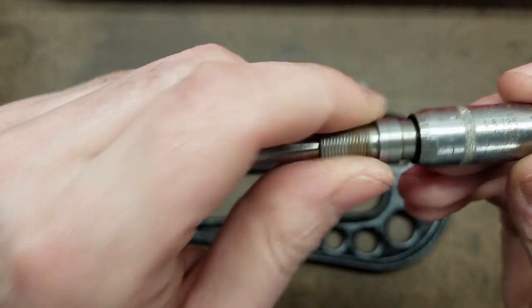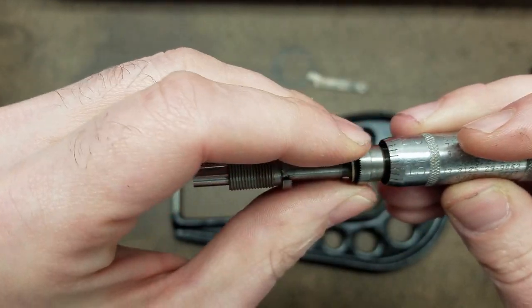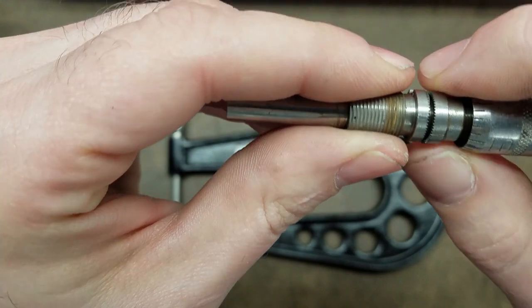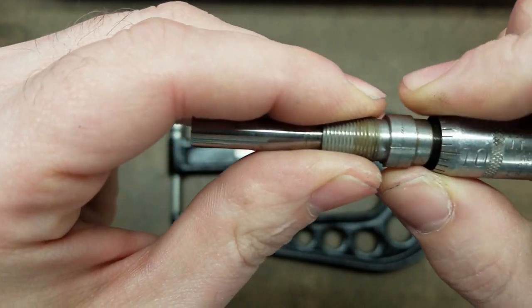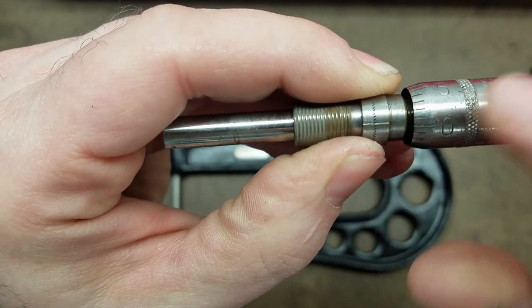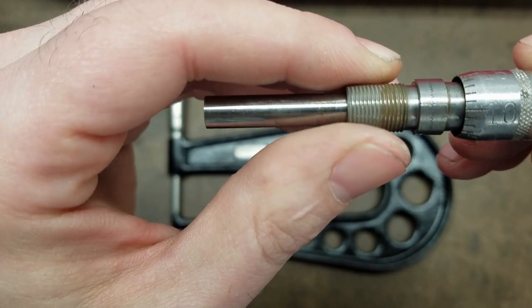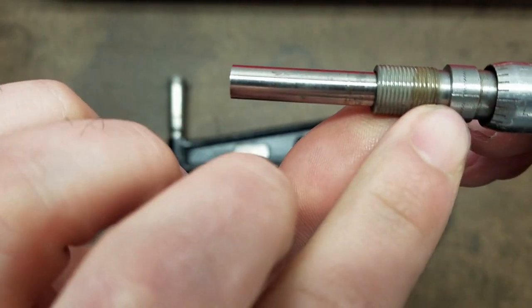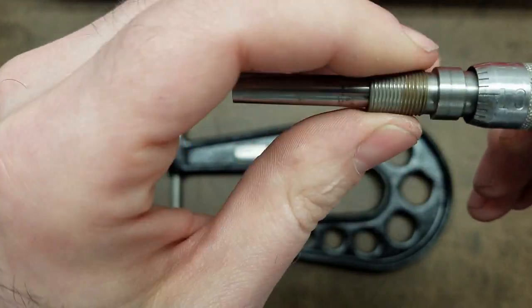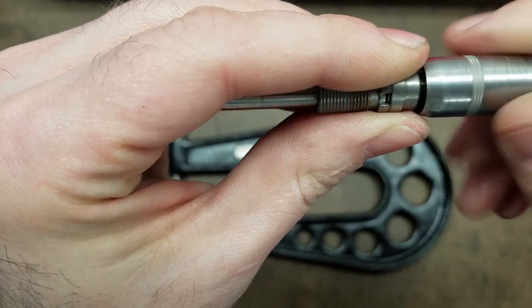This is the assembled version of what's inside the micrometer. The way that this works: you have your adjusting nut, you have your tension spring, and then you have your compensator nut — it all fits together. The marks I showed when I put the micrometer together matter because that's how these two pieces were threaded together. That's the mark that whoever at the factory put on there to show the orientation of the serrations when they threaded them together.